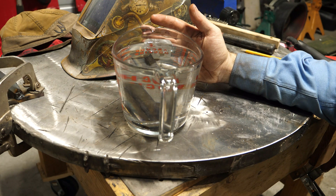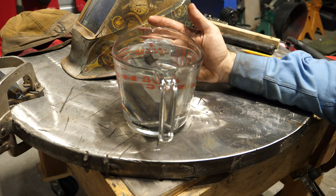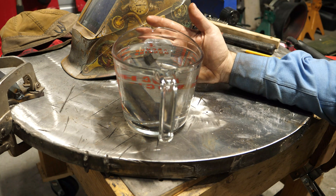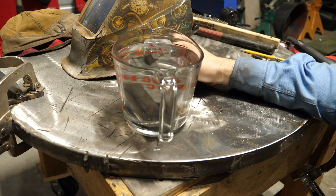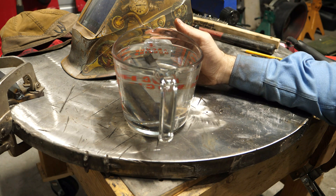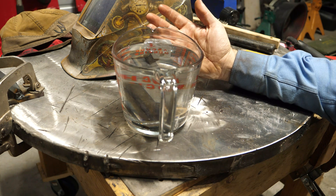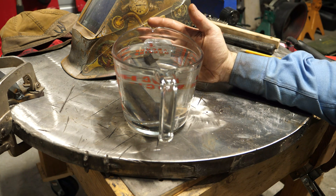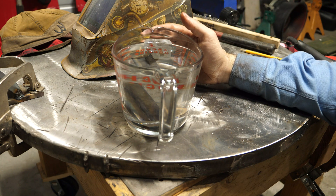There weren't many bubbles, but realistically, keeping the wire out and using cheap wire is kind of asking for moisture pickup. Like, I've looked at dual shield wire and a lot of those specify certain things — like it's laser welded, it has a specified amount of hydrogen per inch of weld in milliliters, all sorts of stuff. They actually test and specify that they meet certain criteria.